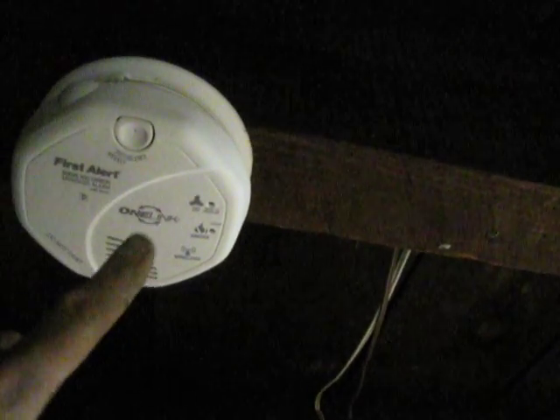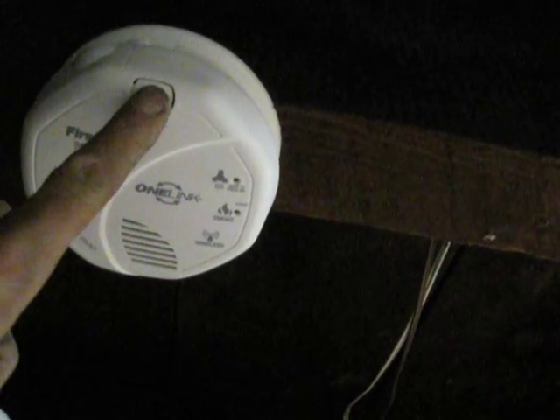We have a smoke detector and combination carbon monoxide detector here. It's going to trigger the rest of the house wirelessly. This is a battery-only unit but it's been programmed to communicate with the other units in the house. You can hear other units beeping — that's a hardwired unit triggered by the test. The unit in the attic is sounding as well. The display says 'smoke/carbon monoxide — ready to detect — zero carbon monoxide.' Every time you test it, it tells you the highest level detected since the last test.